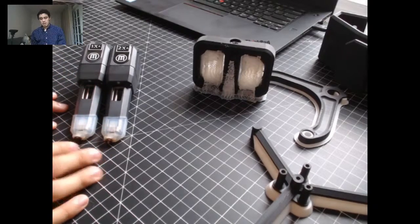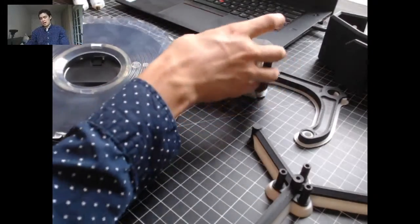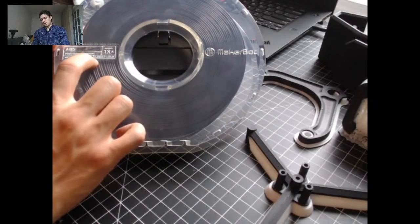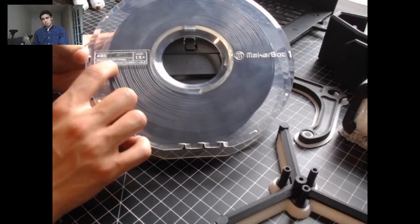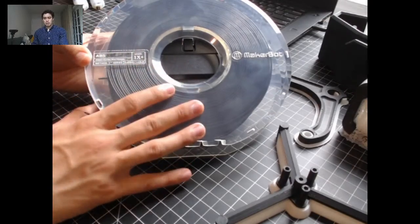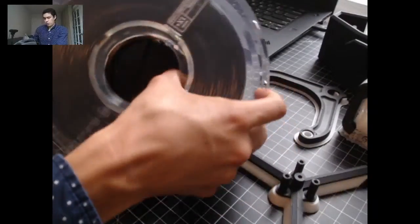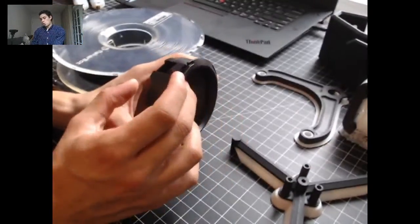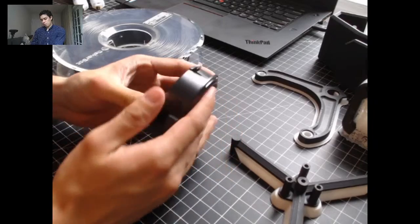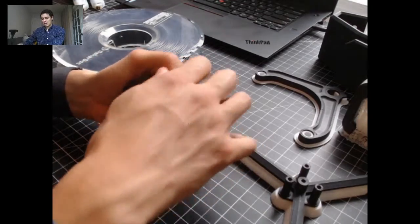So you'll need the Method X, you'll need Extruder 1XA, 2XA, and the filament itself, which I have a sample of right here. This is ABS in black. As you can see, it states the type of material that it is, and the fact that it works with the Method X series. I'll bring it closer. The spools themselves will come at around 1.43 pounds per spool, and each spool will also have, let me open this for you guys, one of these core elements which contains two big things, right? First of all, the inside of this part is going to have a desiccant packet in it, right?